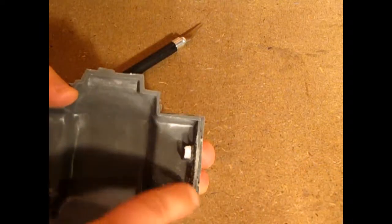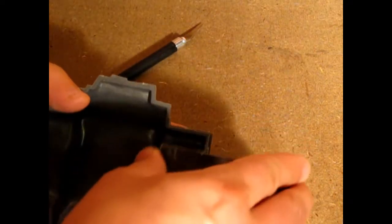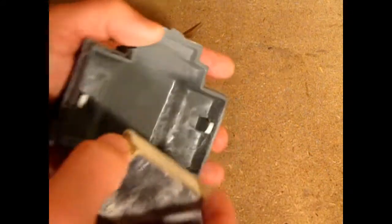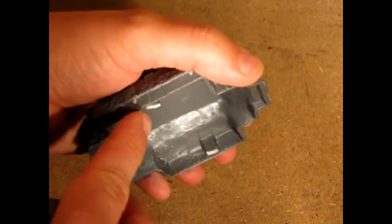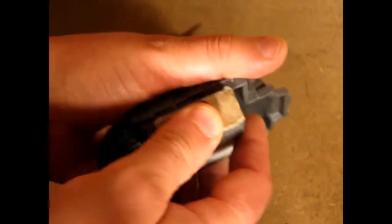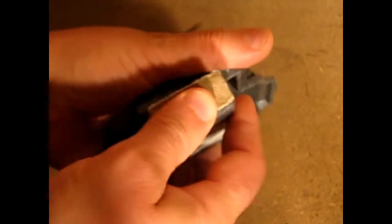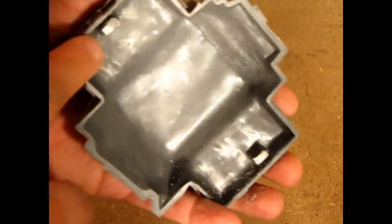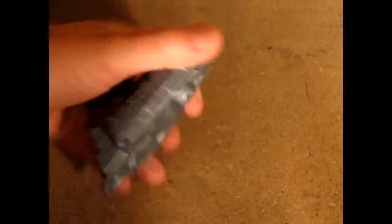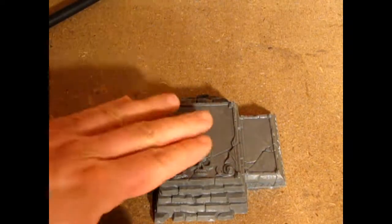just to ensure there's nothing extra gonna hit, just take our sandpaper across here. Yeah, see a little bit hanging down there. So we'll just at an angle, hold our sandpaper, and sand it right about there. And you can see it beveled it down a bit. And now it really fits square to the tabletop.